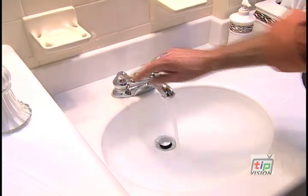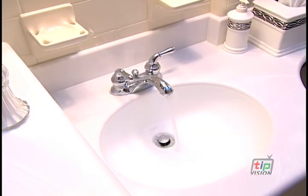Then you need to run to a tap — let's say the kitchen sink — and turn that on. That's going to keep you from having a vacuum in the system, keeping the water from going 'glug glug glug' like when you pour juice from a bottle. This lets it just pour right out of the water heater.